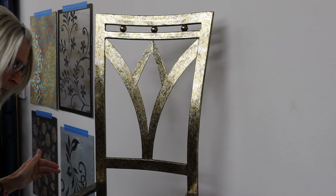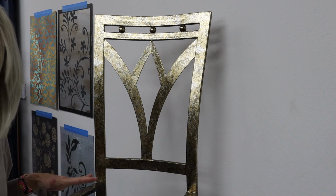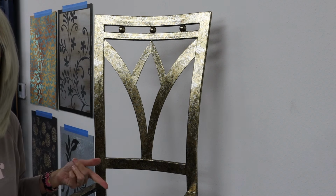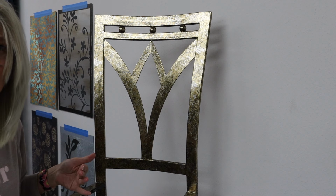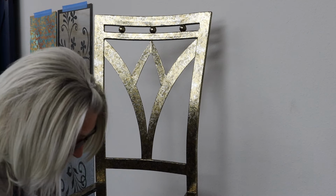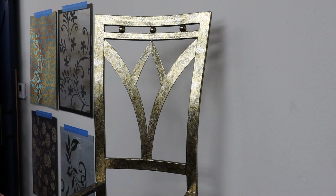It takes only about 10 to 15 minutes for it to dry. So once you're done wiping it on and you hit every spot, it's probably going to almost be dry enough to go back and start all over again. I would suggest probably 5 or 6 layers to protect it because it continues to build in its durability as you layer and layer the coats on here. So that's it, guys. Okay, our final application to finishing off this project.